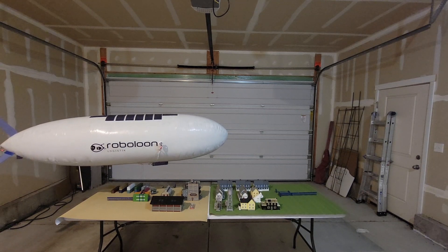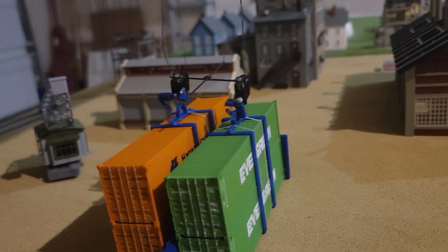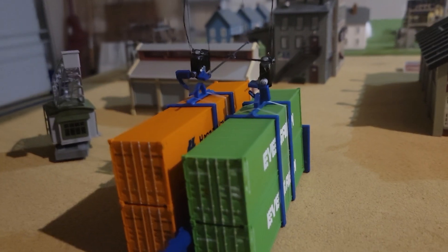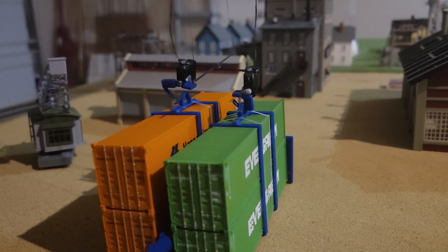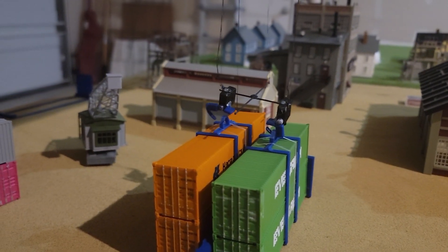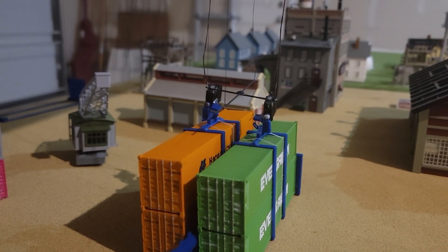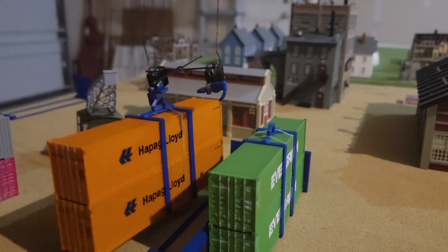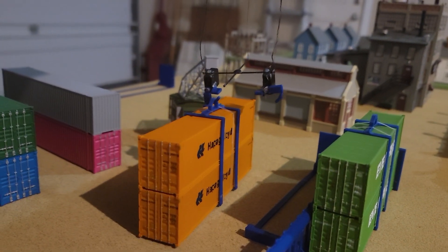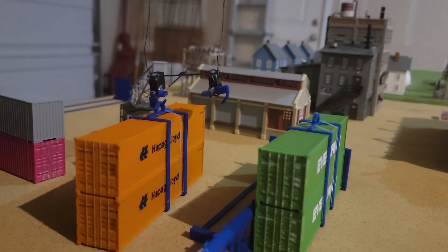I've done some modifications here — I have two servos on the bottom with hooks attached to them. So there are two servos attached to hooks, and one hook is already engaged with the green Evergreen containers, while the other is open and ready to snatch the orange one. All I have to do is actuate the servo on the left-hand side, it hooks in, and now that cargo is secure. Then I release the other container and it bounces up a little bit. It just has to be locked into place so that the alignment is correct to pick up the other cargo.